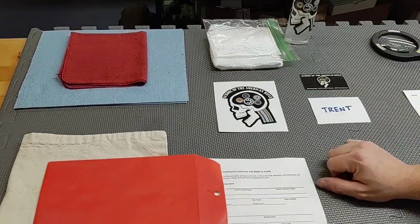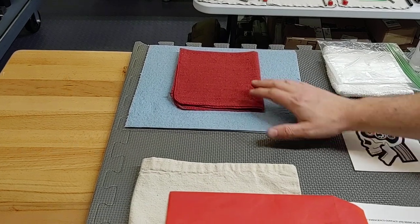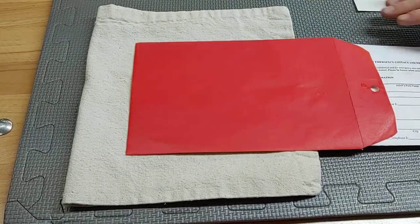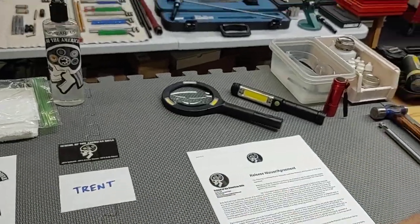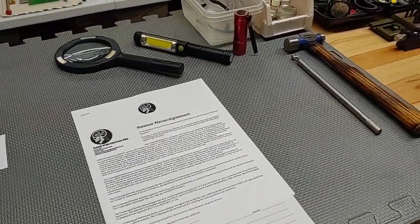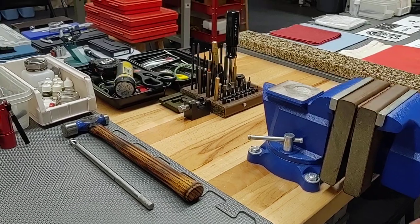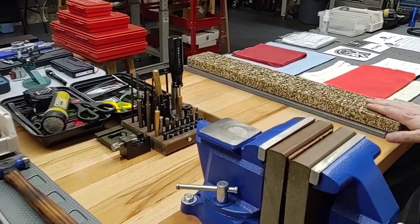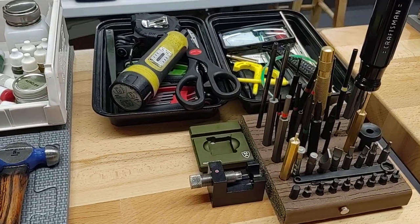These aren't normally at the benches — all the other items are regular items. Since paper towels are hard to get, we have some shop rags here; normally I have a roll of paper towels at each bench. There's a rag for cleaning off the weapon and a canvas mat for contrast — if you lay parts on this black bench sometimes it's hard to see things, so it gives you good contrast. Release waiver, gauge spec sheet, and of course student name tags since we're about to hold a class tomorrow. Then we have various punches, solvents, and tools. Each person has their own vise with some custom-made vise blocks. A slab of granite is shared between two benches — we use that as sort of a surface plate.